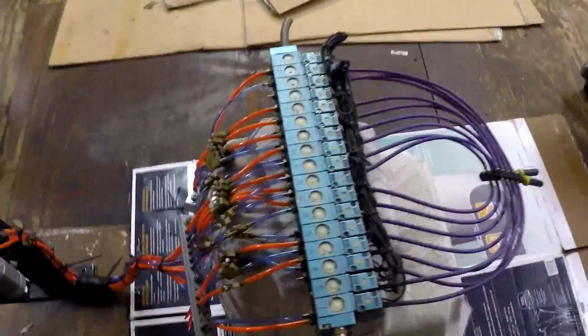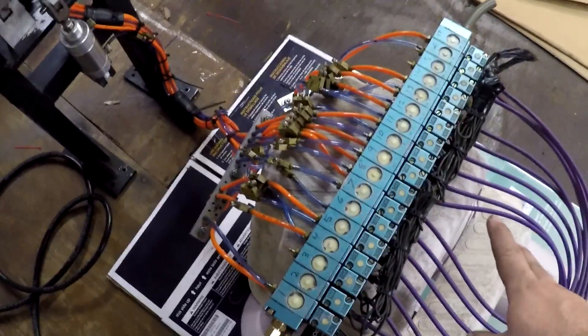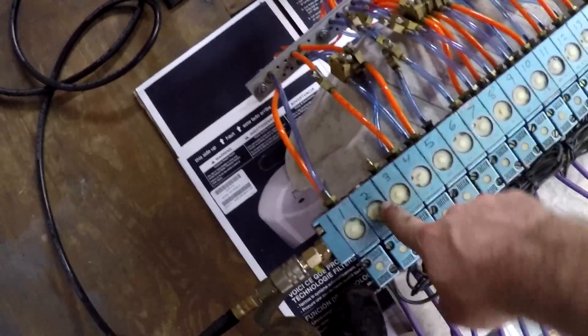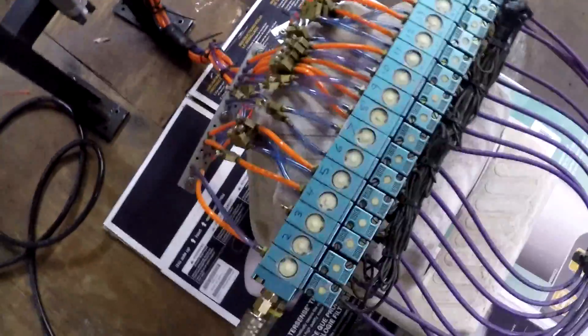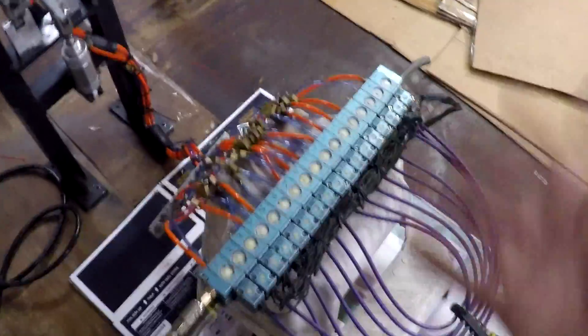I cleaned up all the hose — I think it came out pretty well. I figured out that there is going to be a lot of work that needs to be done to these valves. I'm draining out a lot of air through the exhaust. I switched these two spools around and the air still dumped out of number two, so I just plugged it up. I have a lot of air being dumped out of the exhaust, so I'm going to have a lot of work to do.